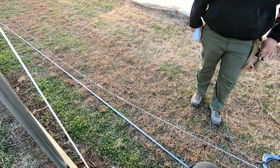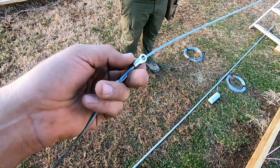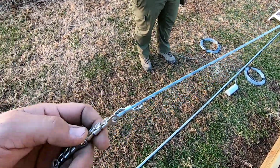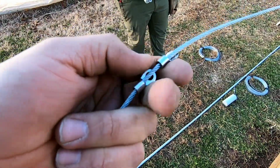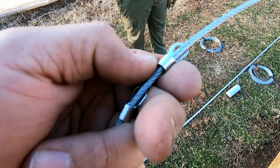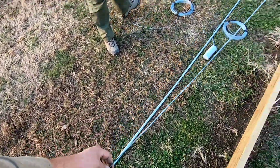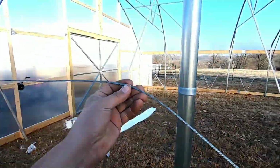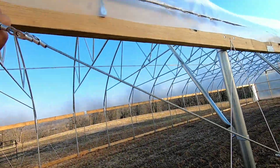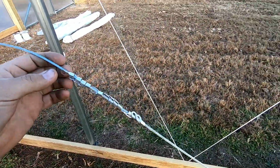And one thing I forgot to mention, before you go ahead and put the cable inside, you want to make sure you put these stake-ons on the cable, because if you guys have ever done electrical work on cars and stuff, you know what these are. They're the kind where you can't split and put open. So we slide these on, and then we have a crimper where we crimp at every single pulley so that the rope, I'm going to explain that when we get to it.